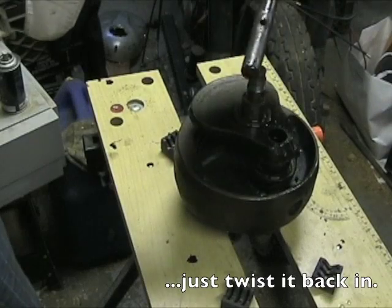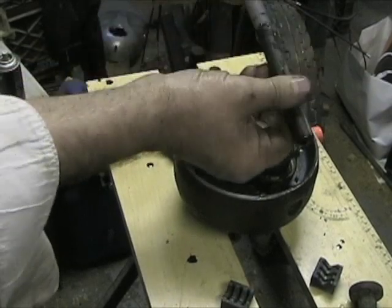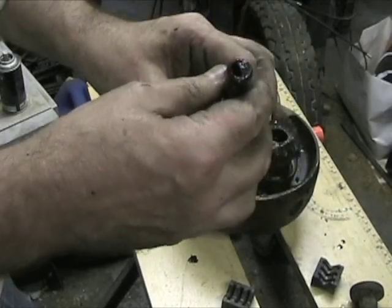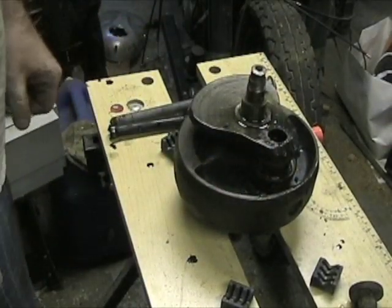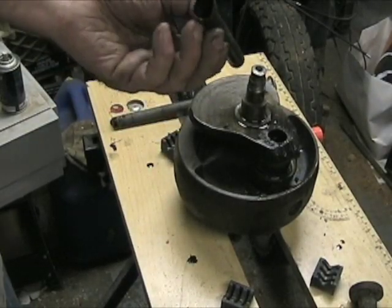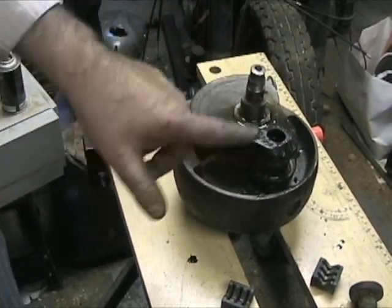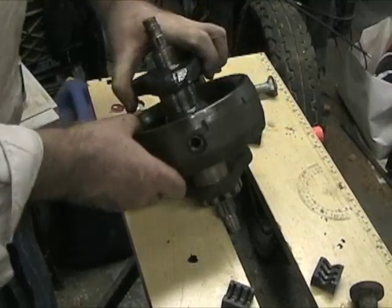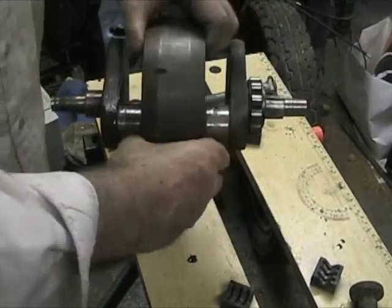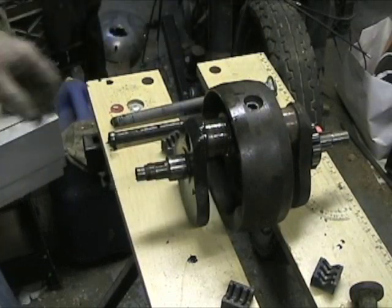And there's the sludge trap. Oh, a little over half full of sludge. So we probably only had another 50 years left on that rebuild. So this has to be scrubbed out with a rifle cleaning brush, and that hole also, and then blow out and make sure these holes are clear. But that's a subject for another video.